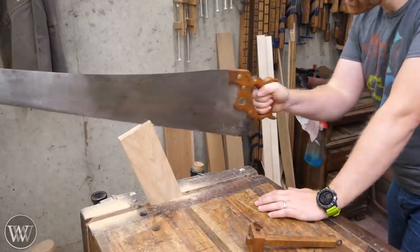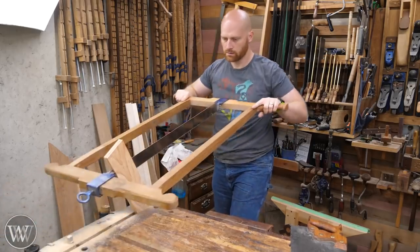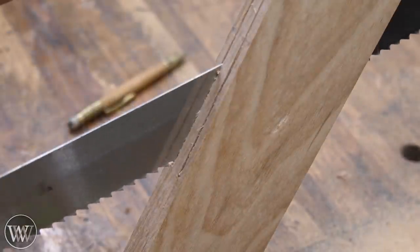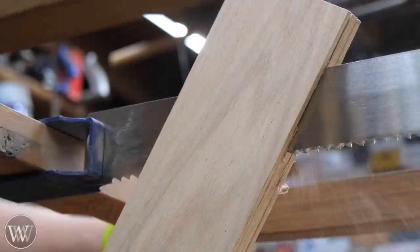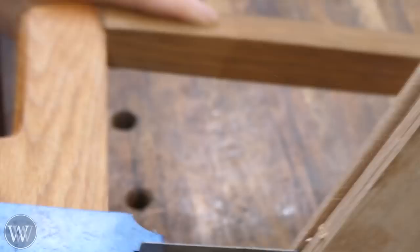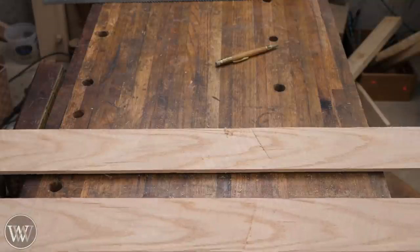If you haven't seen my videos on re-sawing, I've got quite a few where I go into detail on it. Here you can see I'm cutting through about five inches on the diagonal. With the frame saw it's much easier because I get a longer stroke - I can put my whole body into it and you can see how it just marches down through the wood, cutting the two lines side by side. A well-tuned up frame saw is a fantastic thing to have. Keep it sharp, keep the set in it just a little bit, and don't push the saw - let the saw do the work. If you push the saw, you're going to go off-curve.